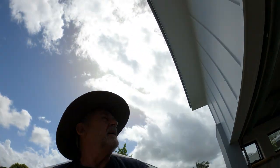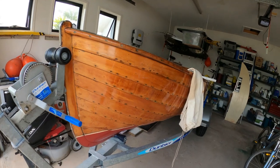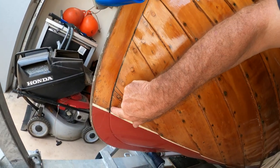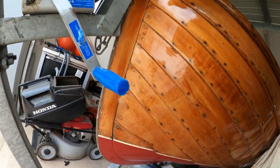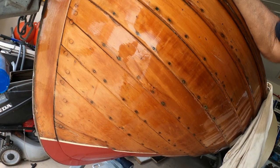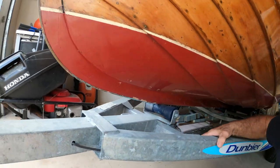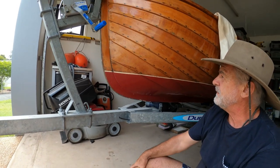In this subtropical climate, with the sun beating down on that garage door, it's just never leaked. You can see here it's Sikaflex up to about this point, and from then on it was originally glued with Araldite, which is a form of flexible epoxy — again, no ingress of water whatsoever. So turning it upside down and filling that garboard seam did a wonderful job, and it's just been a pleasure ever since.